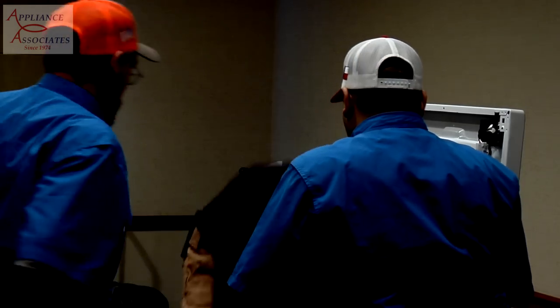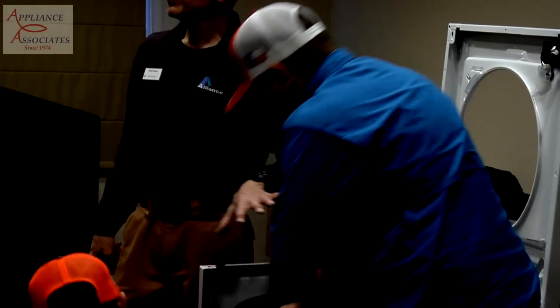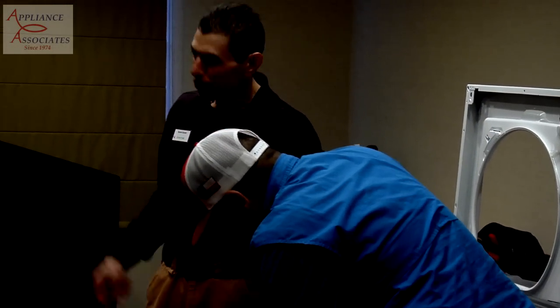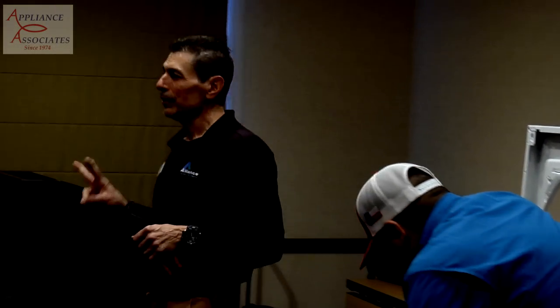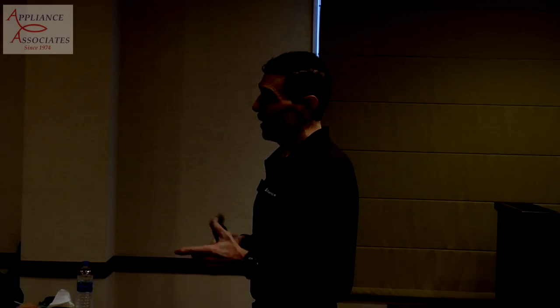So the only other thing, what we're going to do is pull the tub, I mean the module, and you've got springs on the bottom of this. The springs in the front are different colors to the ones in the back, meaning that there's a stripe of paint along it. The 432 uses all blue springs. This machine uses 4 blue and 2 green at the front on each side of the motor. That's to help with the removal of the weight we had with the transmission and the fluids and the brake system. So those springs are greater tension, and the other ones are lesser tension.